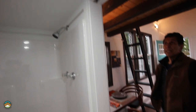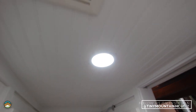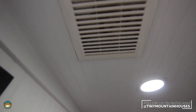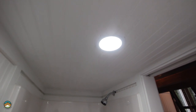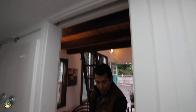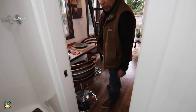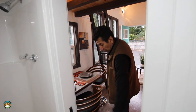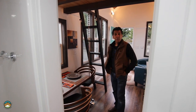We've enclosed the ceiling completely in the bathroom to minimize any issue of moisture intrusion up in that cavity. And as always, there's an exhaust vent that vents to the outside of the bathroom. In this one, we've got two LED slim lights inside the ceiling for plenty of light in that area. And if I didn't mention it already — the pocket door. Real space saver. It takes away a lot of that extra space that a swinging door uses, so it really works well with a lot of our floor plans.